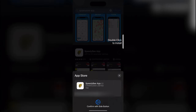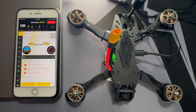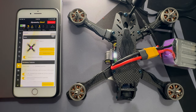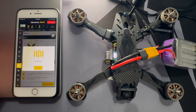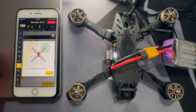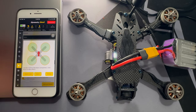Now we're going to try the Bluetooth feature — downloading the SpeedyBee app. We have the SpeedyBee app connected through Bluetooth on the FC, which is really neat. I'm going to change the motor direction just using the app by itself — this is my first time doing it. We got to reorder the motors first because I turned the FC backwards. Props are off — start. Motor two, motor four, motor one, motor three. Save.